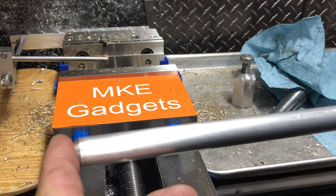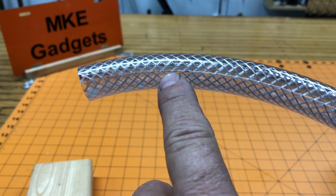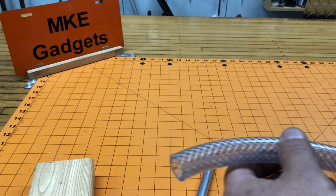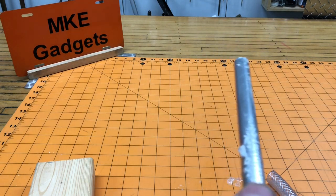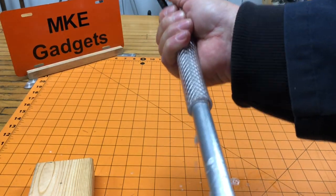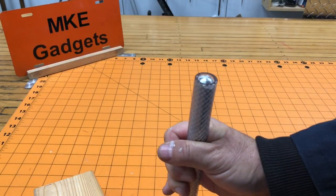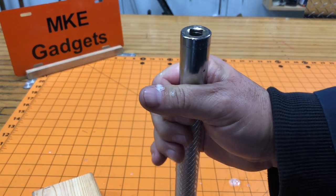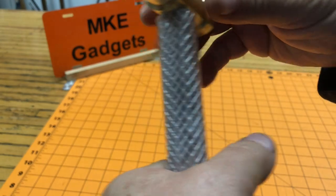Let's take it over to the bench and add a piece of hose for a nice cushion on your hand. We're going to have this braided vinyl hose slip right over the handle — I think this is the hardest part of the whole job. I've got some diluted dish soap; I'm going to spray that in the hose and spray it on the handle, then push it together. But it always gets stuck, so you hit it with a 2x4. To drive it the final distance I've got a socket over the handle. After that soap dries it becomes kind of sticky, and this isn't going to come off at all.